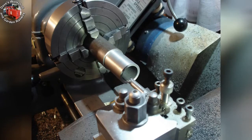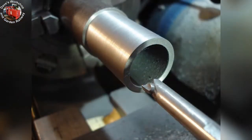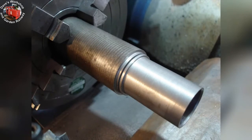Turning the cast iron cylinder — this stock was from the original material supplied with the castings; lovely material, it cut very nicely, so different from the flywheel. Boring out nearly to size — I had previously drilled it with my biggest drill, 1-1/2-inch, and bored after that with power feed. That is quite a bit of overhang. Here is the finished cylinder, just about parted off. Those lines are caused by my lathe's lead screw being a little eccentric.